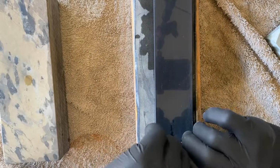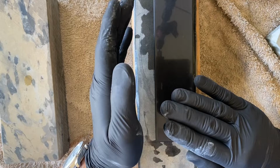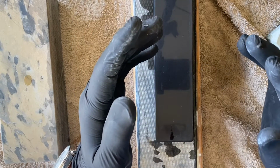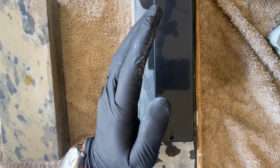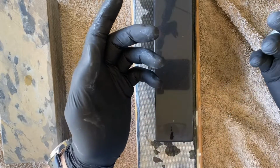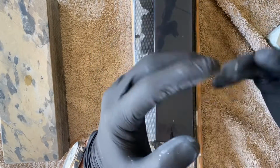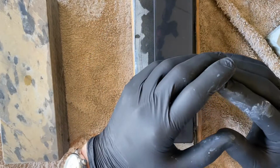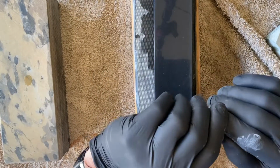So there's two things that are controversial for me, at least. And the one is a convex hone, because it's the one extreme of the spectrum where you're making the edge so thin that the longevity is really not worth it with the effort and the maintenance all on the stones. And the other one is on the other side of the Goldilocks spectrum, if I want to call it that, and that is adding tape on a spine. So one is you're making the edge as thin as possible, and the other one you're increasing the bevel beyond the design. So once again, play and experiment, come to your own conclusions about what you want to do. For me, it's a suggestion, and if you look in my videos, even for bevel sets, I don't use tape. If you've got the need to use tape, by all means, go ahead and do that.